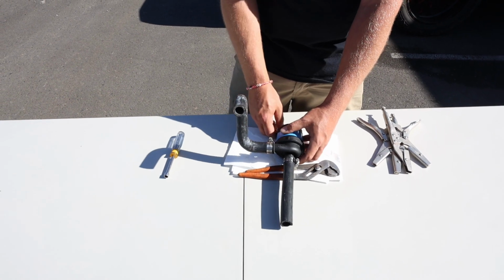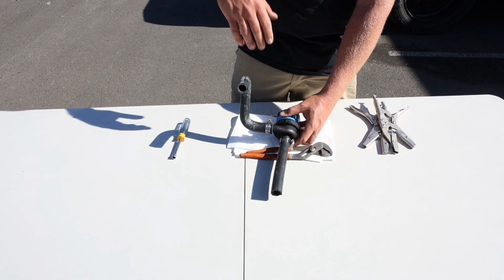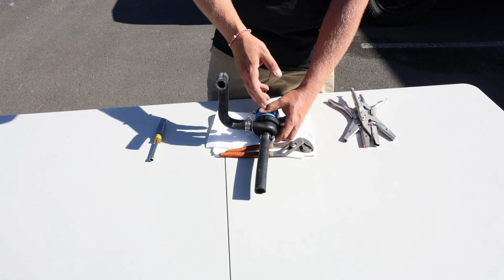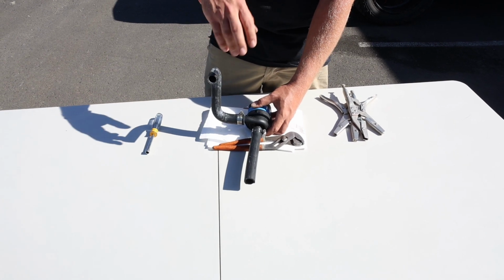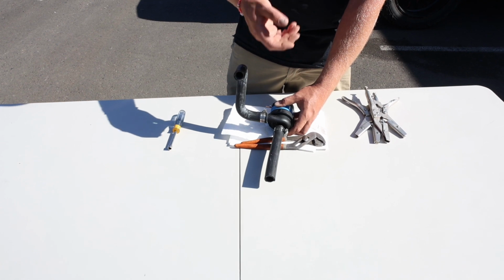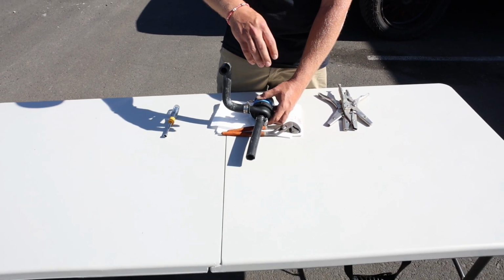Now at this point you haven't actually powered anything up. You've wired it, you've re-hooked up the plumbing. Now we're going to go turn the system on. And this pump should take off. It should start to push a bunch of air bubbles through the system. You should hear a little gurgling through the reservoir. And at that point you should be able to open your reservoir and visually see circulation in the reservoir.